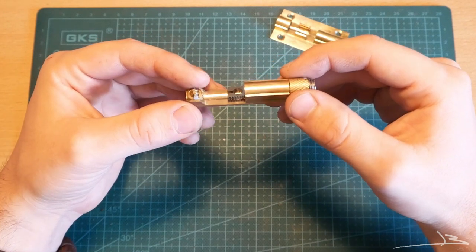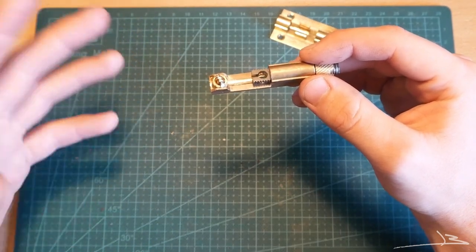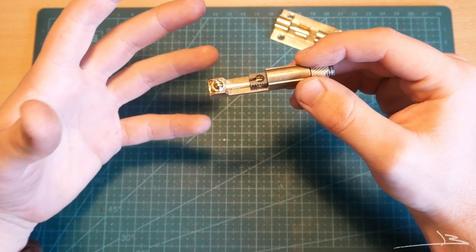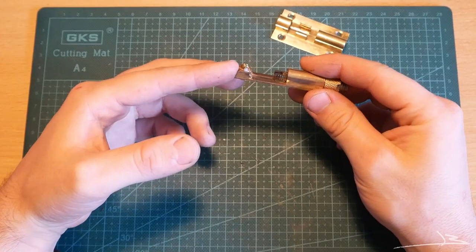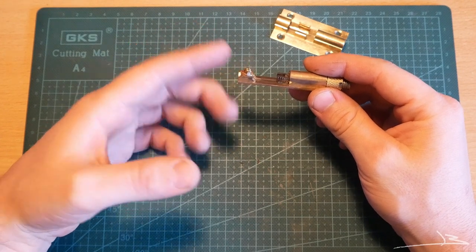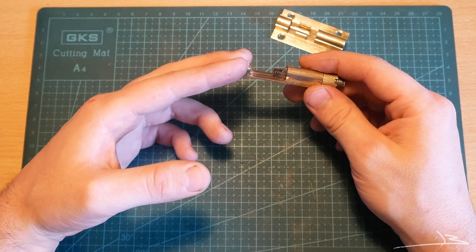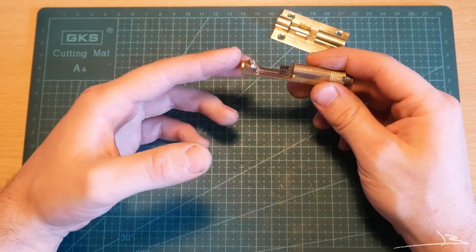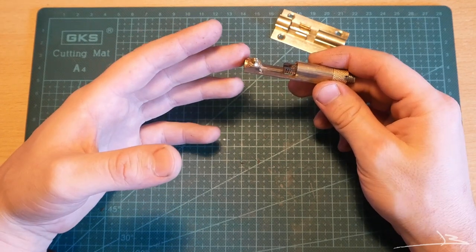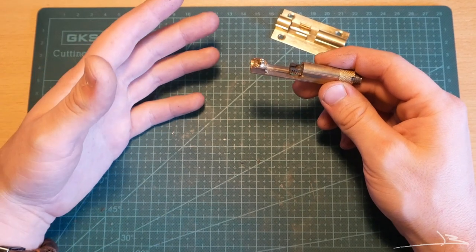There is a lot of precision work here, and my drill bits are not sharp enough, or my drills are slightly not concentric, which is really, really not ideal when trying to work at this high precision. So with all this, even though they would have looked very nice, I see myself having to try another idea for the tuners. The only thing I can do now that has high enough precision for this task is 3D printing. And I know it sounds at least weird to think about 3D printed tuners, but apart from buying them, this is my last option of making them with the tools that I already have here.